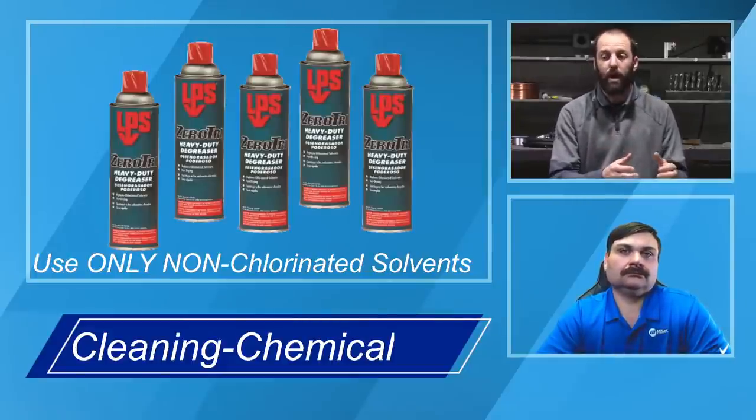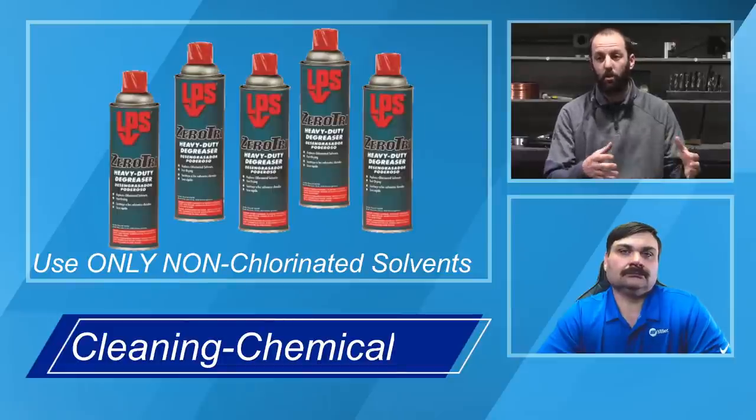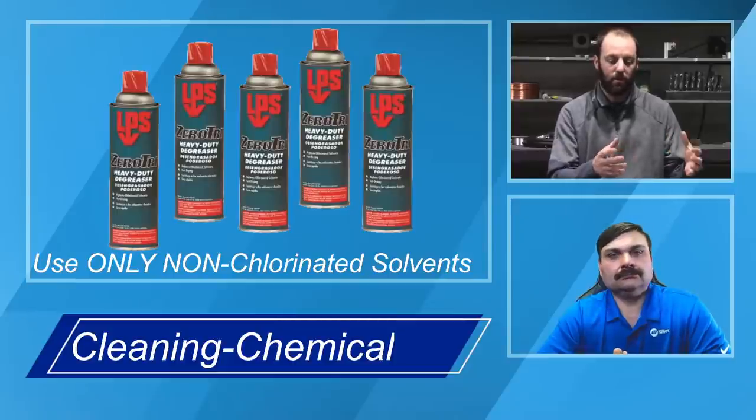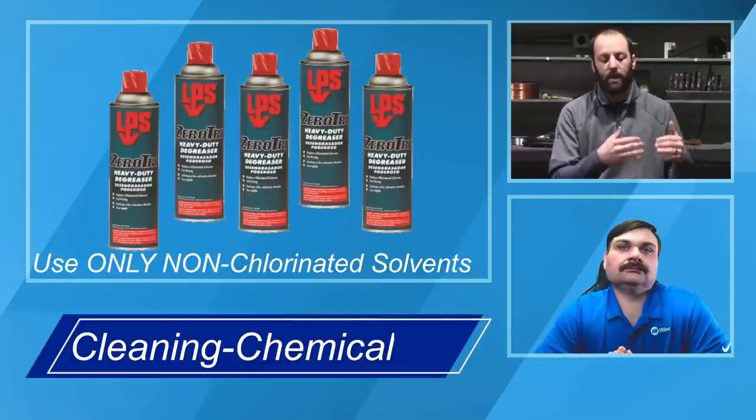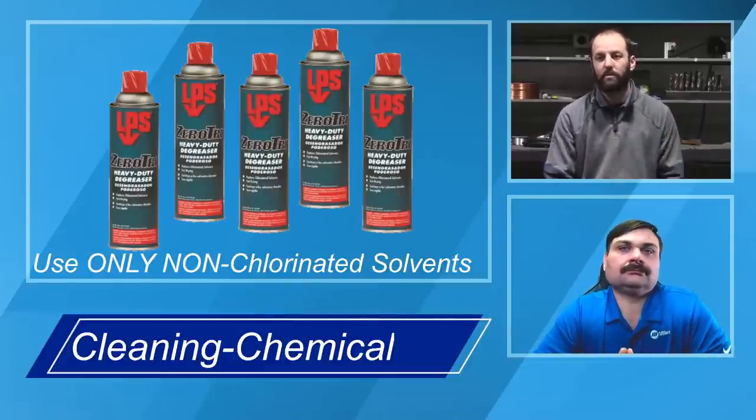And they will do that immediately prior, once they verify that the part has no residue left on it. Everything's evaporated off of it, anything maybe from the solvent that is left there would be evaporated off of it. They'll remove those cleaning materials from the welding area and then immediately go to and commence welding.